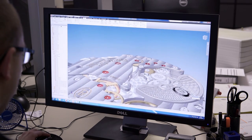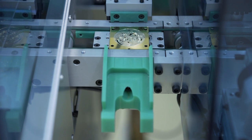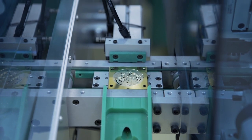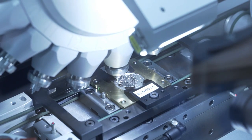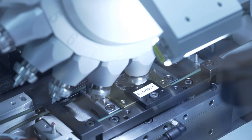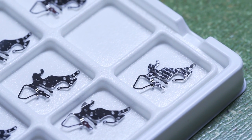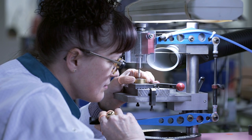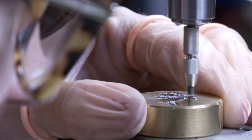With the use of CNC machines, we work on a piece of metal to prepare the place for the various elements of the movement. Movements are sometimes composed of more than 400 different parts that have to be manufactured individually. This is also one of the Parmigiani signatures: we decorate every single element of the movement, even the ones that you do not see, because we know that one day a watchmaker somewhere in the world will dismantle the watch to service it, and will have the opportunity to discover the beauty of the movement.